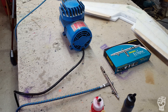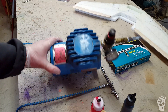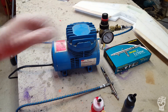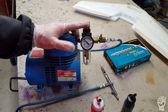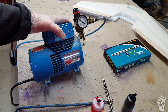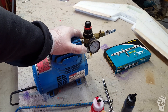A simple paint job can be done in an hour, maybe two hours. This is the compressor I use — I was given this one; I think they go for about $100. You don't need something like this; a really cheap one from Harbor Freight will work just as well. You do want to get an air-water separator though, because when you compress air you compress the water vapor into water, and you don't want that getting into your air stream and wrecking your paint job. In winter it's not a big deal since the air is dry, but in summertime the humidity can be a problem.